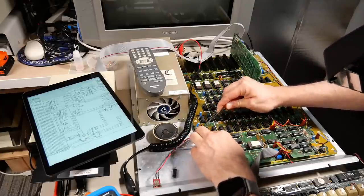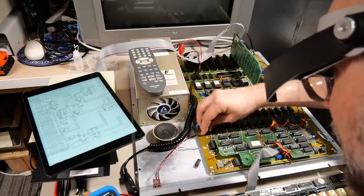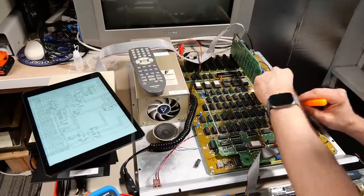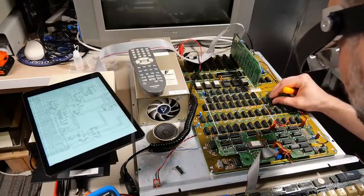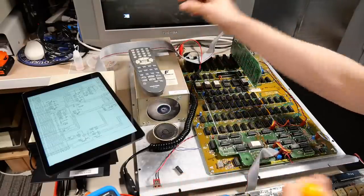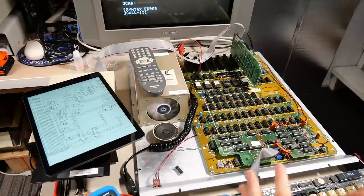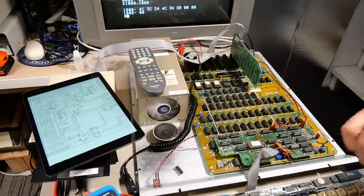Let's pop this chip out of here. And pin 4 definitely seems okay, I guess. Let's pop a different chip in here. I'm just going to substitute the chip I had in there over here on this spot. These are also 153s. Make sure the computer still works. Okay, it does. And I'm just going to double check to make sure that it's still having the mirrored memory problem. Yep, it's definitely still mirrored.